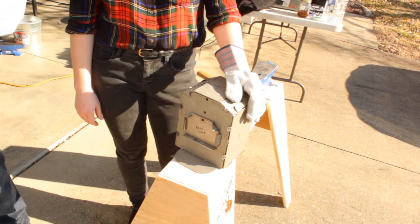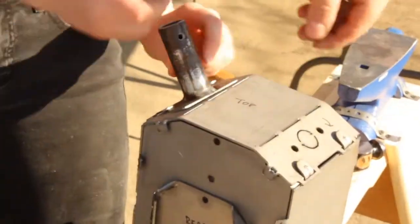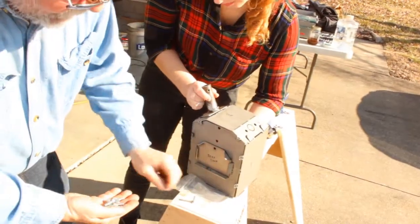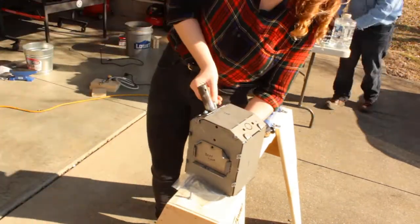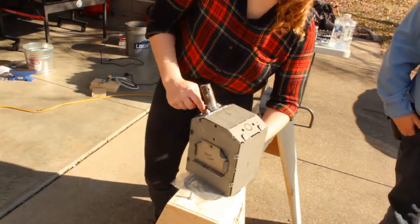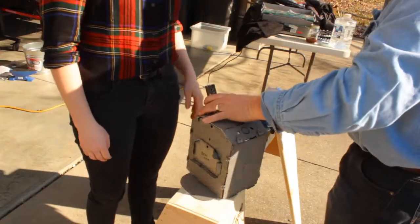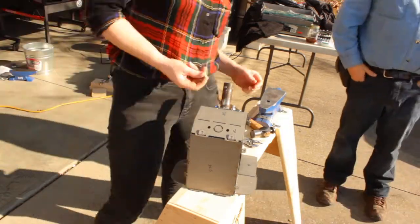We're ready to install the burner mount at this point. Put them in from the inside, and that way you can get to the nut on the outside. If you will run those three thumb screws into these three holes, that's your next step.